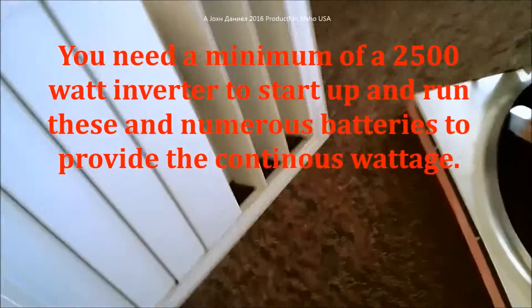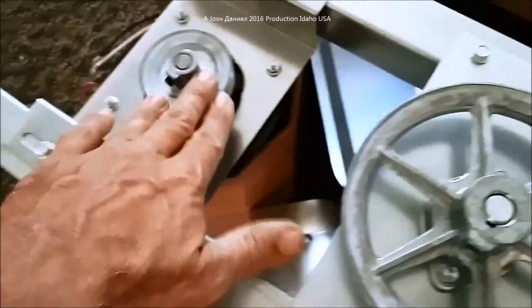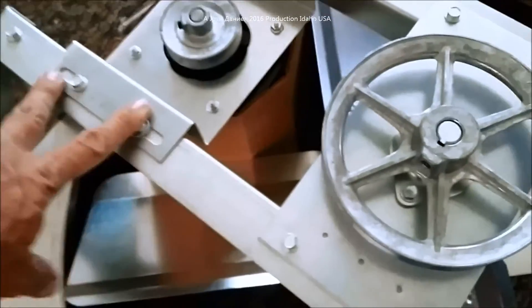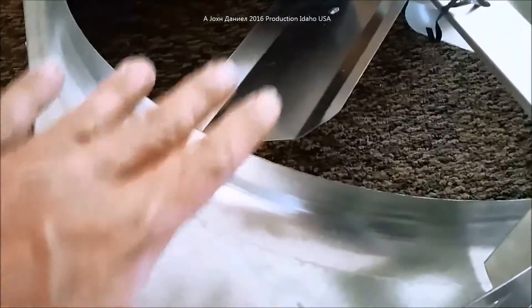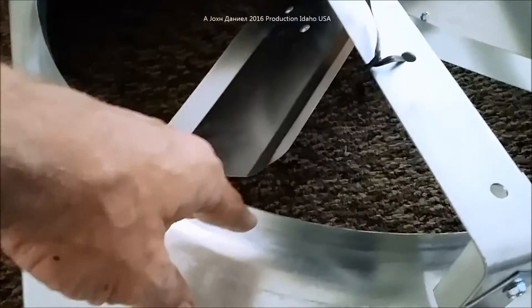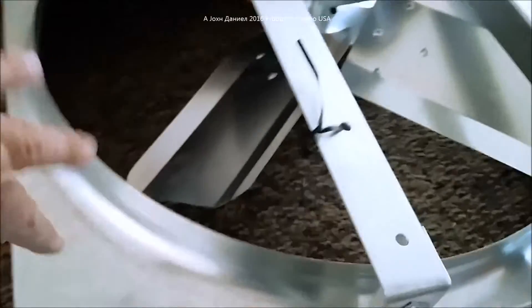Installing this unit with the automatic louvers — the whole thing is about $130. The motor is shipped upside down inside the cardboard. You take the bolts out and the motor flips over, wiring and all. You want to make sure your house insulation stays as high as possible. If it's blown-in insulation, get a roll of 10-inch flashing and run it through, notching it around the angles so you can build the insulation levels back up around the unit.